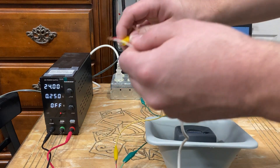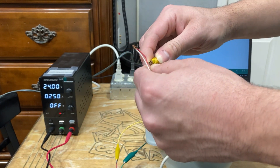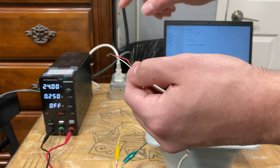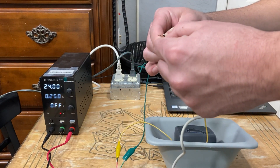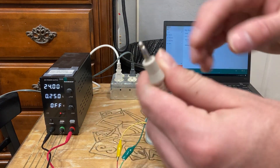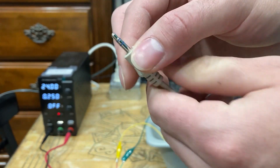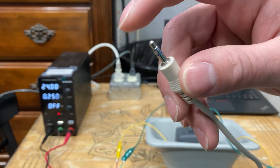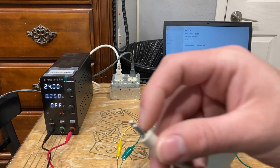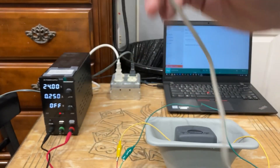This yellow is my ring — this will go to the bare copper wire of the 3.5mm jack. My two combined stereo channels will be my tip. Where I'm getting tip and ring from is this jack here — the top is usually your positive, which is the tip. Then the ring is the last connector down here, which is usually ground.